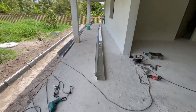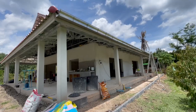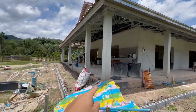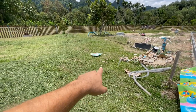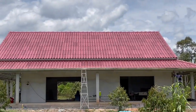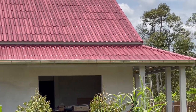This is what the gutters look like — they're stainless steel, welded or brazed together. That's about eight inches across. I've decided to do all four sides, and I'm going to have four downpipes — one at each corner — to get the water out into the farm. Once it hits here, maybe dig channels or something. They're putting a slight slope on the gutter: the middle is the high point and it slopes down towards each corner. Let's get these sprinklers turned on and see where we're going to plant those avocados.